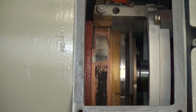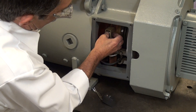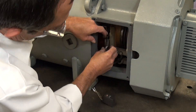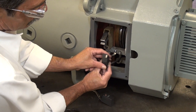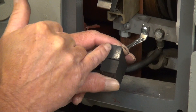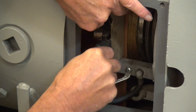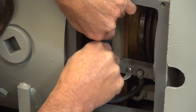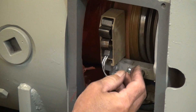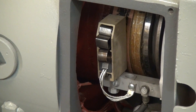We're going to use approximately 120 grit sandpaper. We pull the brush out and look at the face of the brush — you can see where it's changed color. Right now we've got this particular area seated, but this area isn't, so we put the brush back in the same way we took it out and rotate it around again. We're going to continue this until we get about 90% contact minimum.